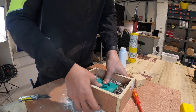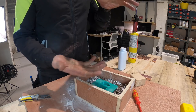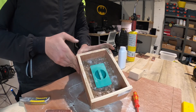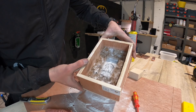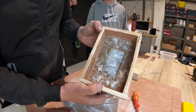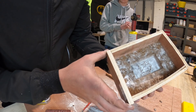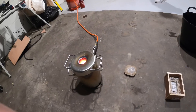The problem is I asked my brother to make a chamfered edge to get the mold out, but the chamfered edge most of the time is when you mold it the other way — you mold onto it, turn it over, pull it out — which we might end up having to do. Let me give it a bit of a tap. Hey, that's not too bad — some of the stuff's come out but as long as you've got the outline. Have you got a funnel? No, we'll just pour straight in — so it's obviously going to be a shallow one, but the copper's all ready.